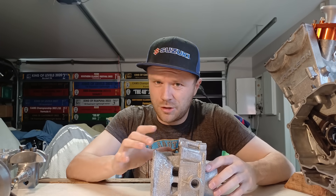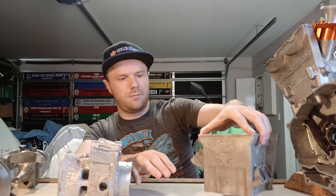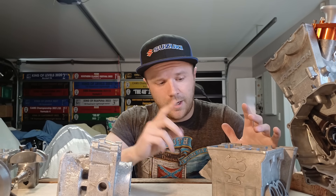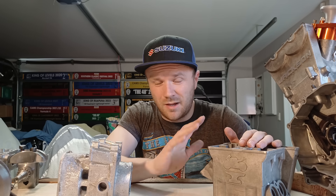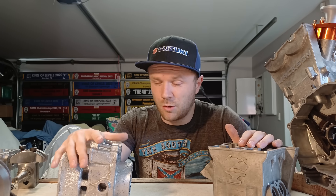I've come to the conclusion it was too cold. If you look at this failed cylinder head from quite a while ago, the surface finish on this is amazing compared to this. The problem with this was the mould was actually far too hot and the casting was molten for at least half an hour after I'd poured it, compared to this which was probably solidifying far too quickly.